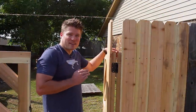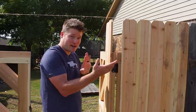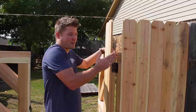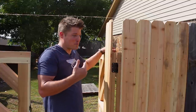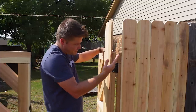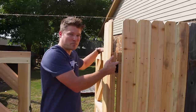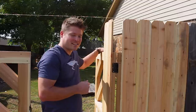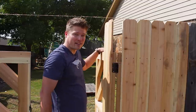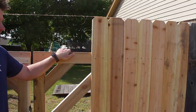One of the major design details I love about this fence is that it opens towards the inside with the planks on the outside, which allows me to lay these planks one next to the other without worrying about where the joints of the gates are. Since it opens to the inside, even if a plank overlaps one of the joints it will either stay put or open inward with the gate itself, and when you shut the gate it overlaps right back next to the original plank — so it looks like a gate was never there.